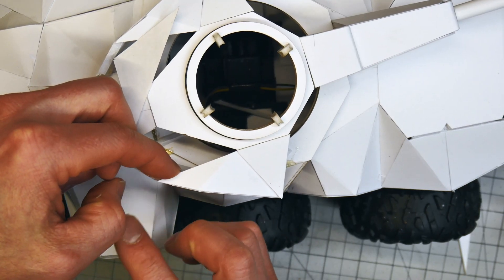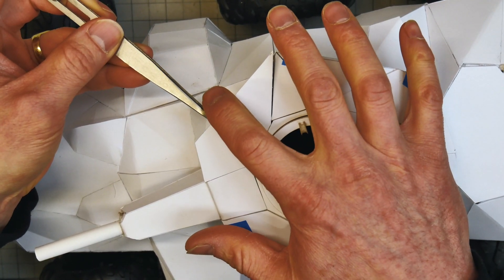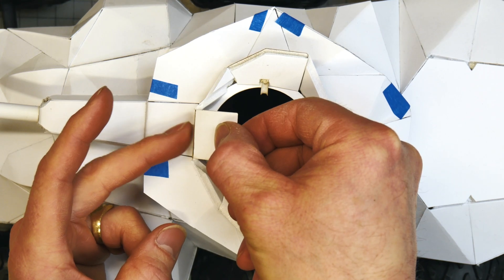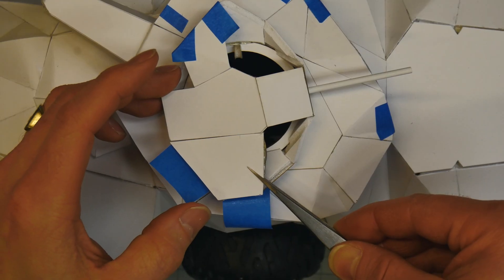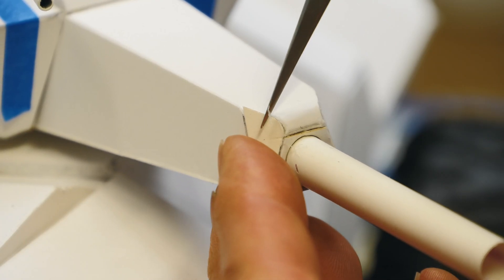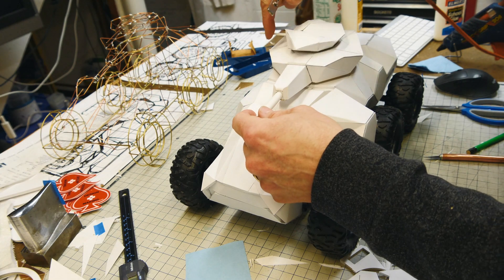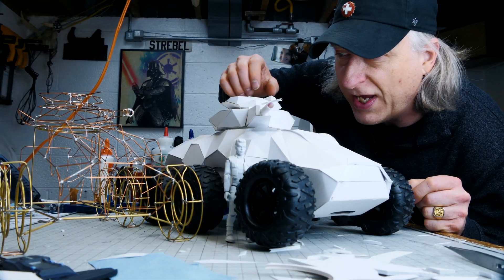Whatever your tank concept or military vehicle would be, I feel building a foam core vehicle full size with some sort of a wooden substructure would be immensely beneficial before you build any sort of a prototype. It'll allow you to get in it, sit in it, get some different views and a feel of the scale. It wouldn't cost very much, and I feel it would be a great way to serve as an in-between — between computer and full-size mock-up — for testing out basic functionality.